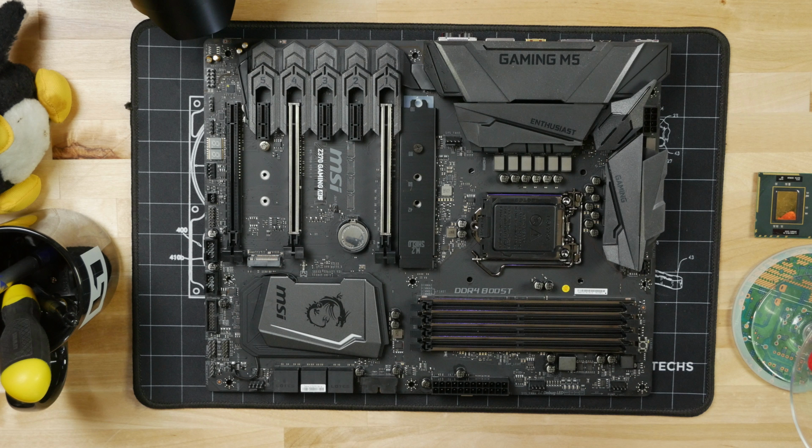In terms of physical connectors on the board, there are 6 fan headers, one for the CPU, one for a water pump, and then 4 system fan headers. Those are 4-pin fan headers. It's a pretty neat setup as far as the fan goes, in terms of fan control and being able to set it up to respond to different situations and things like that.